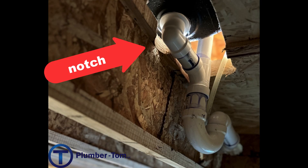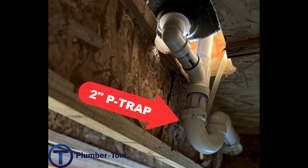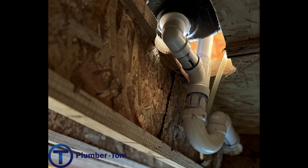The plumber did what he had to do to get that tub hooked up. Another thing I really like is this plumber used a 2-inch p-trap — not a code requirement, you can do 1½-inch on a tub, but a 2-inch trap gives better flow and is less likely to clog. He ran it all the way to the tub using a 2-by-1½-by-1½-inch sanitary tee to connect the drain and the overflow. That's a really good setup. Wherever possible, if you can use a 2-inch, I think it's a really good strategy.